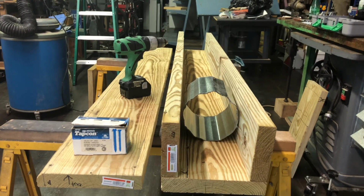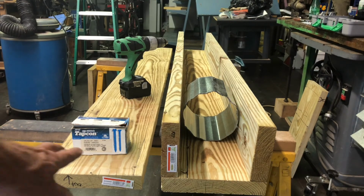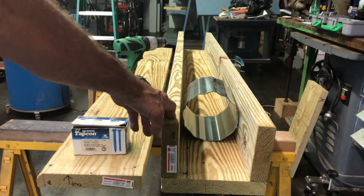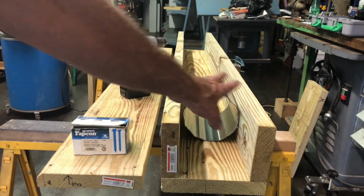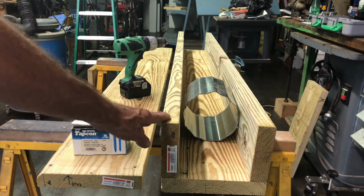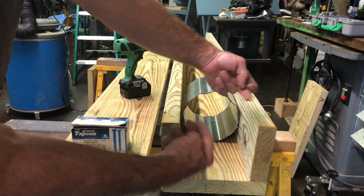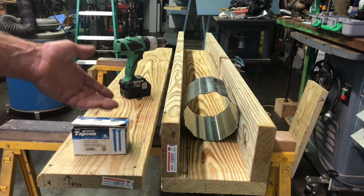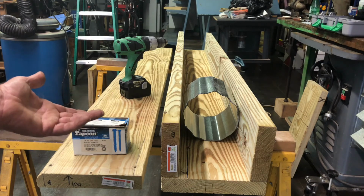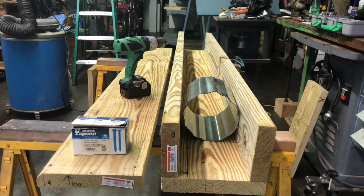But what I am going to do in the meantime, since it's going to be sitting idle, is I'm going to go ahead and take this top, and I'm probably going to put about half those screws back in. And that's just taking out insurance against this warping or towing out between now and when I take this outside to mount it in place. So a little time spent securing it in place might save me a lot of aggravation down the road. Alternately, I could put it on and put C-clamps on it, but I'd like to let the screws do the holding.